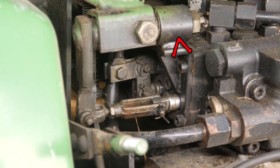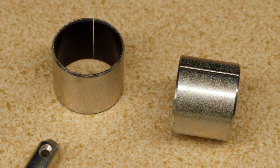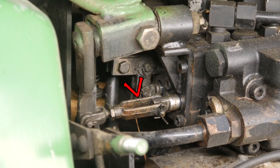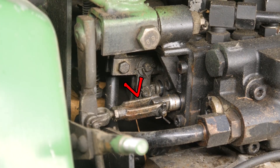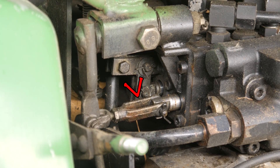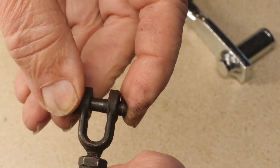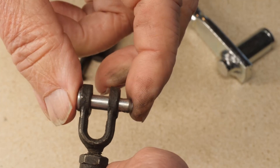The pivot support has two galvanized bushings that thankfully are sacrificial. They are expensive for what they are, but are available. This is not so for the double ball joint, so this one will just have to do. The turnbuckle is now subbed by two metal straps, part numbers AM-96583. New pins will correct center pin wear and indicate there is negligible wear in the turnbuckle yokes, so the turnbuckle will not be replaced.